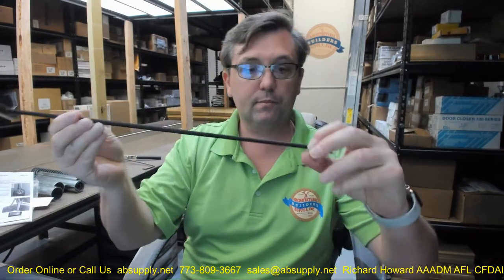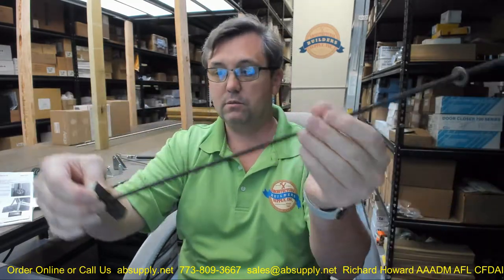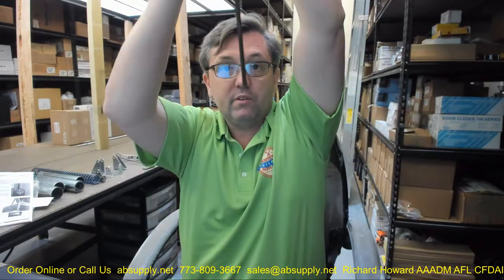This is the compression tool. You're going to remove the threaded block, take all of it and fish it through the hole down in the top of the upper telescoping tube, all the way down and out through the bottom. You'll then get that threaded on there and rotate it until it stops. Insert the free end of the rod into the top of the cylinder, guiding the rod through the center of the spring until it protrudes from the bottom cylinder and foot — which is the sidewall bracket.